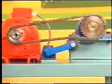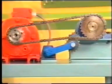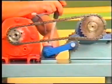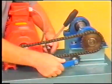Tensioning devices are always placed on the slack side of chains and close to the driven sprocket. It must be noted that the suspension arm lies in the same direction as chain movement. Failure to install a tensioner, as described, will result in excessive vibration. During maintenance, the tensioner, by loosening a central mounting screw, can be moved away from the chain.